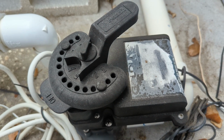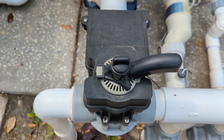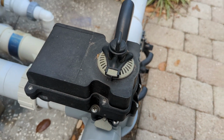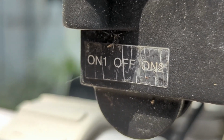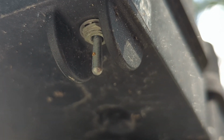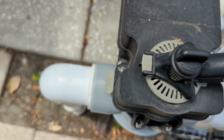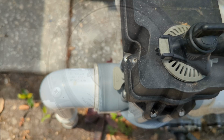This automation simplifies switching between different modes of operation and means that you won't have to make any manual valve adjustments. Many valve actuators have this little toggle switch, which allows you to direct the flow of the water. If a manual adjustment is needed, make sure that you use the toggle switch. Don't try to turn the handle. Valve actuators are not designed to be turned by the handle. The inside gears can get damaged, and if they're damaged, well, now you have a problem you didn't have 5 seconds ago. And many times, they can be controlled using an app or remote, so you can have the setup you want.